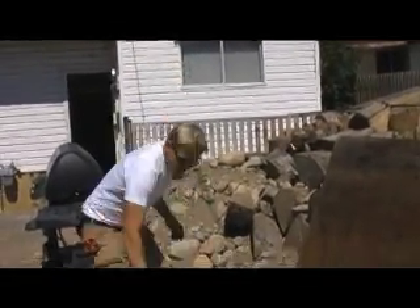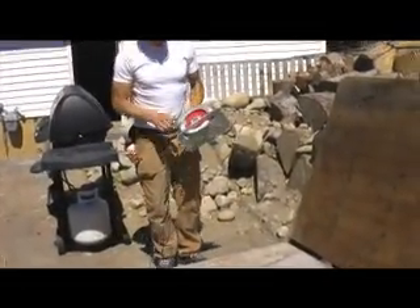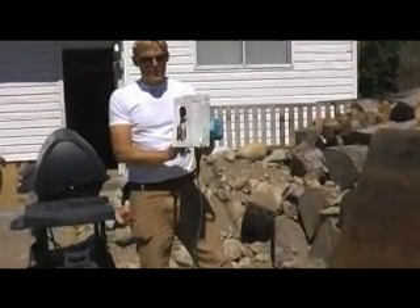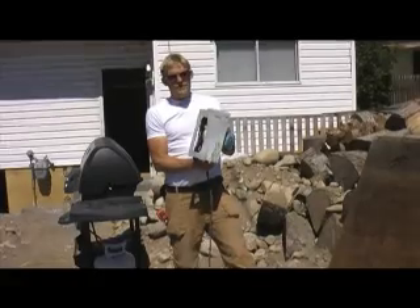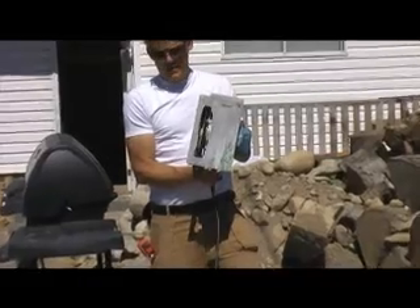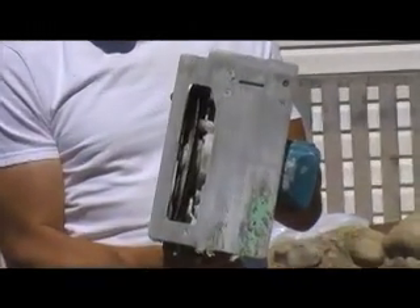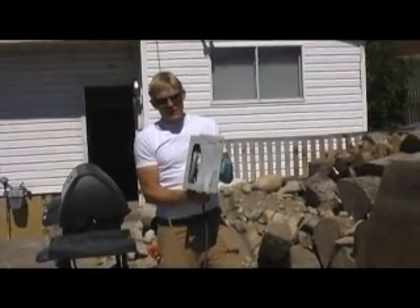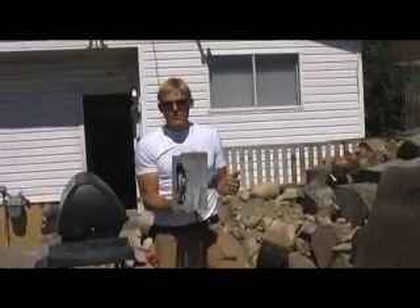What we're going to be doing is taking a circular saw with a Freud thin kerf blade and slicing into the plywood. If you rent concrete forms, they will be routered out — they use a very small router bit to router out the plywood itself. However, this is a fast, easy way to do it and it works very effectively.